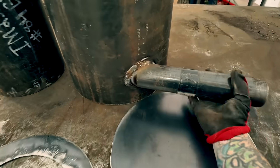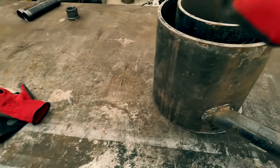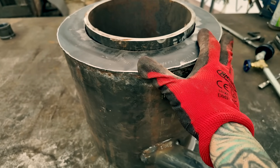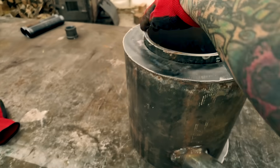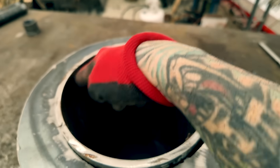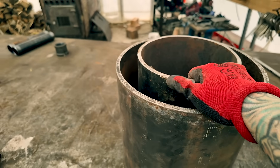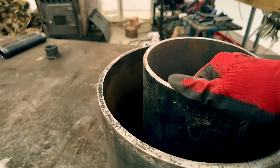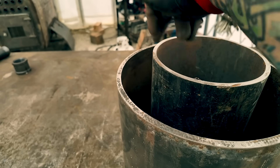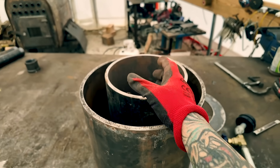This is the solid bottom plate — it welds underneath. This ring goes on top, acting as a cap, sliding over both pieces and centering up. Air comes in, circles around inside, and blows out through the holes I drill on the inner piece. A pipe comes down and drips oil into the center. I'm going to lay out even drill holes — quarter-inch holes, rows of five all the way around, then stagger rows of three inside for a lot of surface area.